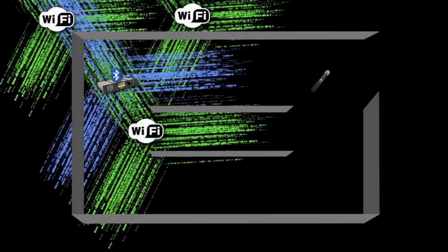we placed a Bluetooth transmitter on top of the receiver. Bluetooth transmits on all frequencies in the 2.4 GHz band, our chosen band of operation. Then we placed Wi-Fi transmitters at various points, operating at higher than normal usage percentages.